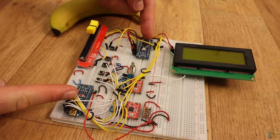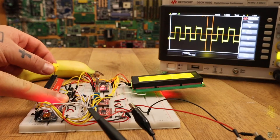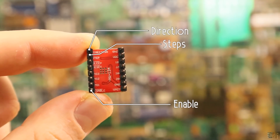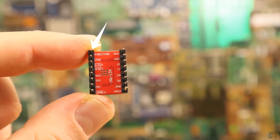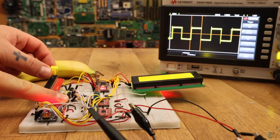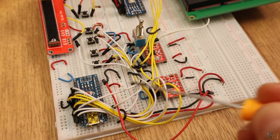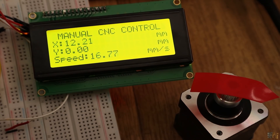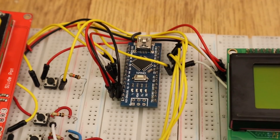You're probably wondering why I have two Arduinos. If I use only one, I would need to make a lot of interruptions for the step and direction pulses for the stepper motor drivers. This driver needs an enable signal, a step signal, and a directional signal. The direction of rotation will be right if the direction pin is set to high, and left if set to low. To the step pin we apply square pulses, where each level change is one more step. Using just one Arduino, each time we print the distance to the LCD screen there was a small delay in motor rotation, and we don't want that — we want steady speed set by the linear potentiometer. So for just 2 more dollars, I've placed a second Arduino.